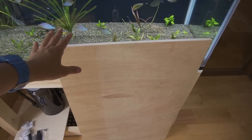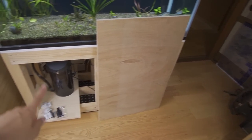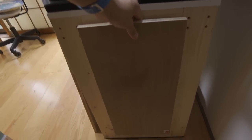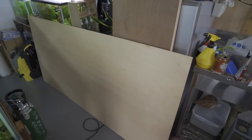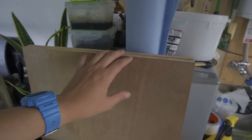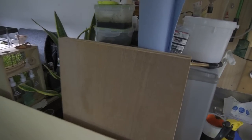I've got a bunch of this plywood laying around. It's not the best looking, but we're going to cover it with a cleaner looking sheet to make it more aesthetically pleasing. I'm going to cut these up to fit so that we have two doors and a side panel. This smaller piece was almost the perfect size — just got to trim it a bit. This other plywood we'll cut to size and stick on top. You can see the big color difference — this one is much lighter and will match the stand better.